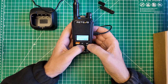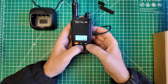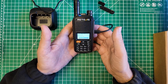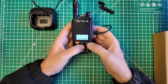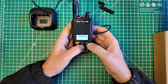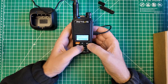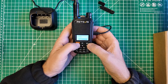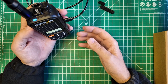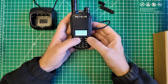We're going to leave that with no offset because I've already programmed in a transmit and receive pair. That could actually be very useful if you were trying to program in a satellite where the transmit and receive are on two different frequencies. Channel memory — save it to channel four. All right, we got it back. I was horizontal, the repeater's vertical, and I'm close enough that probably matters.